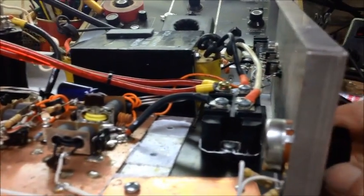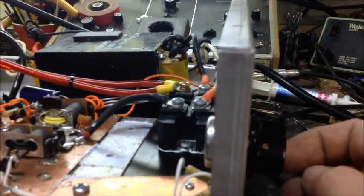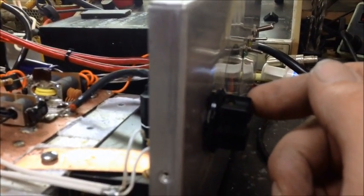But if you have a radio that has variable power on it, my suggestion is to leave this rascal wide open and let the radio control everything. If you turn this back, you will lose output wattage too. That's what the variable does: it cuts watts back to run the desired dead key, so in turn you lose output power also. Take that for what it is, that's just the nature of the beast.